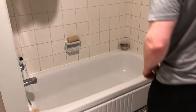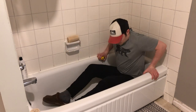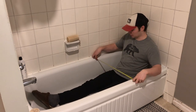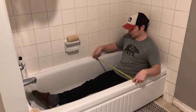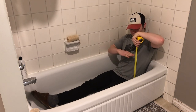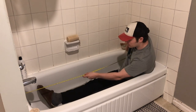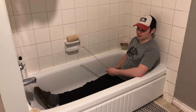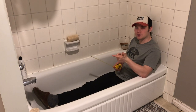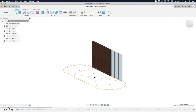Now that I've done the sketches and seen the design, I need to decide on dimensions for the tub. I want it to seat me and my girlfriend comfortably, but every inch I add will really increase the time it takes to heat up. The tub is about two feet wide, which I think is more than enough room, and about 20 inches deep — I don't want to fill it all the way up. Once it's built, four and a half feet in length — I think five feet would do the trick, so 20 inches deep, 24 inches wide, 60 inches long.